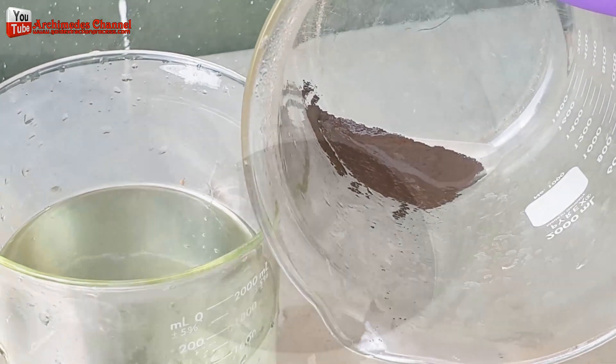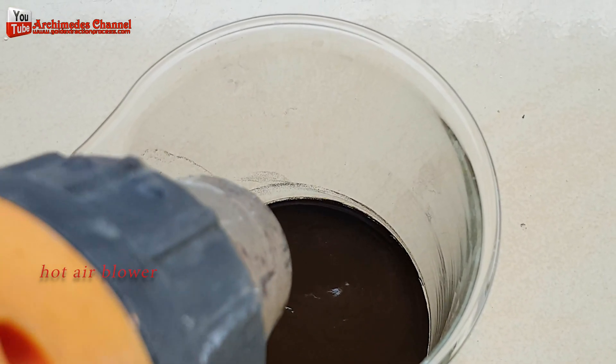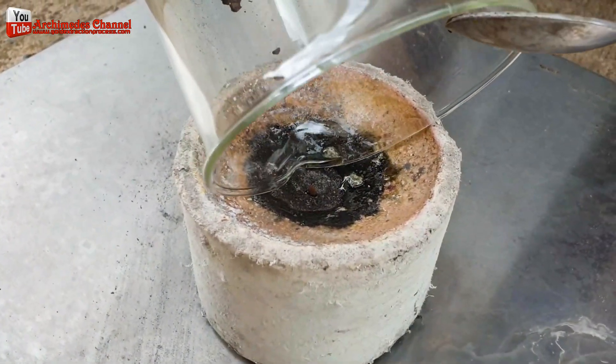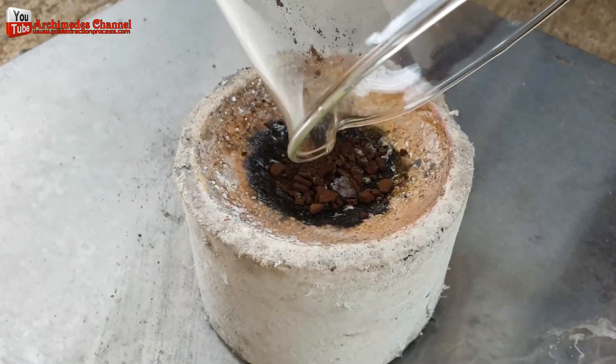To make dry gold powder, I use a hot air blower — I think it's the easiest method. I used to use a hot plate but the gold would splash. If you have a better way, please suggest. You will get gold powder after this step.